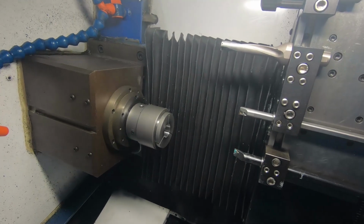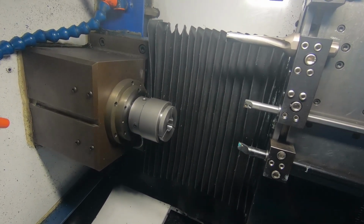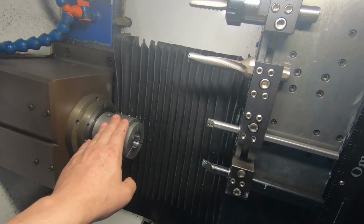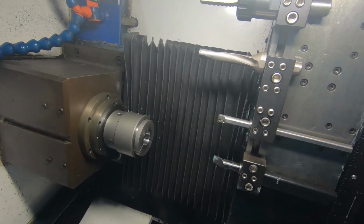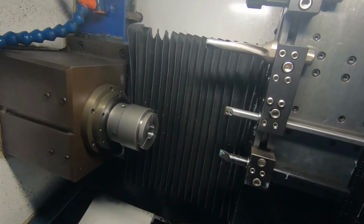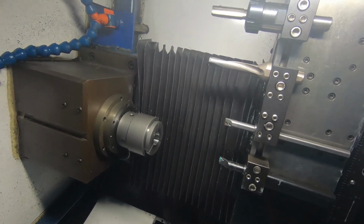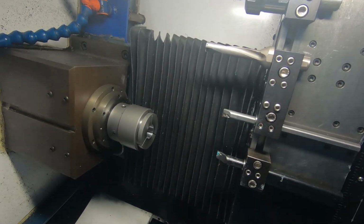But compared to a Tormach, just their base machine starts at right around $15,000. And with automatic collet, because the Tormach comes with a manual collet, that's like a $3,000 option, and the enclosure is a $3,000 option, and it doesn't have servos like this. It has steppers, and I believe it doesn't run on linear ways. It's just some sort of dovetail.